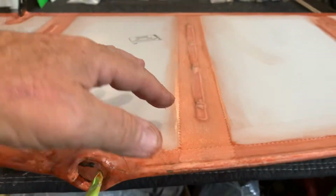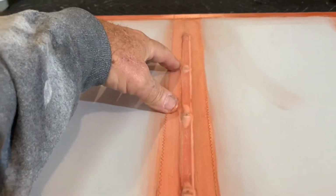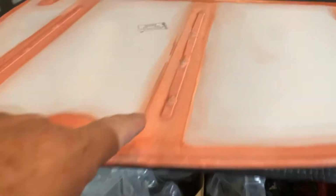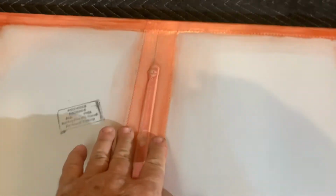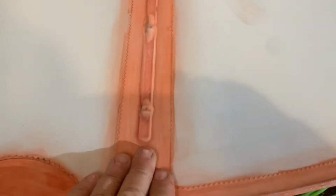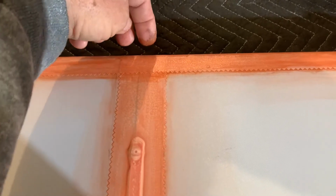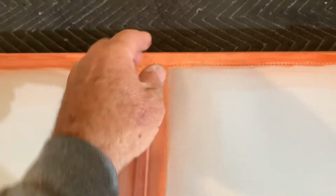Then, of course, what you're going to do is, I always, on these tapes, and I've talked about this before, I just take my 2-inch tapes, I lay them out, and I just cut a straight cut here and a straight cut here, and then I lay it over when I put the tapes down dry, but into a wet bed. So I put a good heavy coated poly brush here, lay the tape down, and then where that edge is here, it was pre-cut nice and straight. I just put it where it's going to be in about the center. And I get that side started.